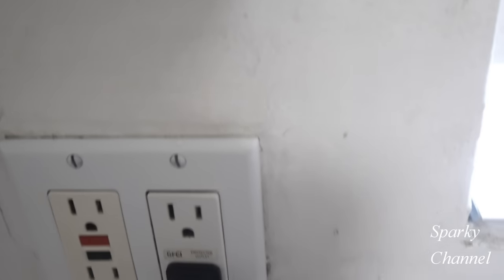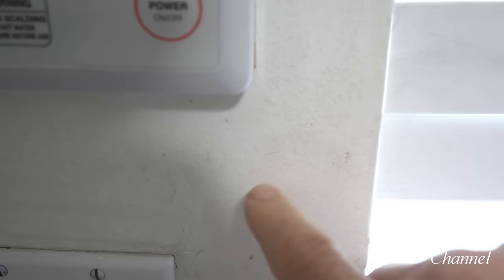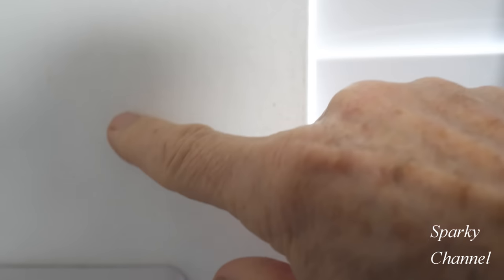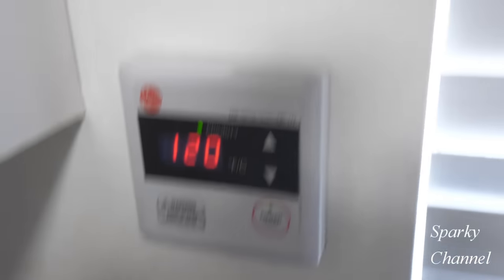Okay, we'll go up right here. So it looks like the cable enters right about here from our readings, and it goes up here. There's probably an inch of plaster, and then a jack stud, and then a king stud. And so it's probably stapled to the stud right here. We found one spot where it went in a little bit, and it just goes up to the ceiling. So we traced our wire from the receptacle to the ceiling.